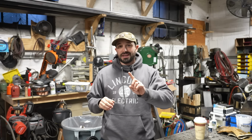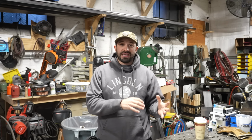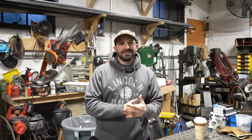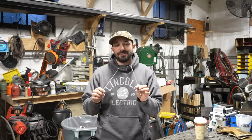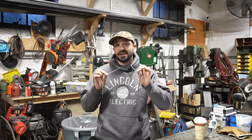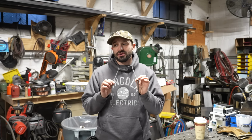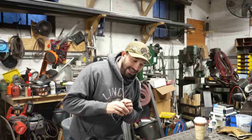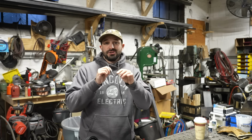So first things first, I always like to start any sort of tip video around safety. It's the most important thing. If I teach you how to drill holes in steel, but you get wrapped up on your sweatshirt strings the first time you try to do it, you're gonna have a bad time. So I specifically wore this sweatshirt so that I could cut these strings off and show you that it's not worth it to risk leaning over a drill press and having one of these sucked in to the drill press.